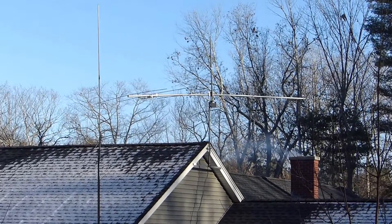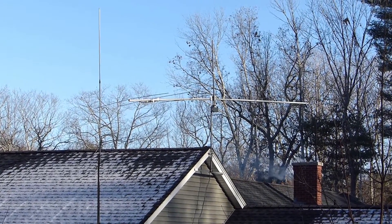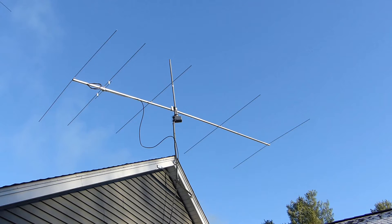The next two antennas are mounted over there on my house. The first is my 6-meter 5-element Yagi. I picked that thing up for almost next to nothing at a ham fest — it needed a little bit of work before I put it up. I had to replace one of the elements, and you may be able to see there that it's kind of bowed in the middle. The previous owner had it on a tower that fell over, so the antenna took some damage, but I was able to repair it and put it up. It's really not the most sturdy mount for that type of antenna — it's a little bigger than I really need, but the price was right.